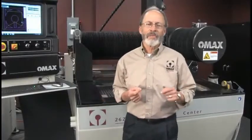There is a myth out there that the key to faster cutting in abrasive water jet applications is higher and higher pressure. But that myth simply is not true. The key to faster cutting is power at the nozzle. For example, a 60,000 PSI OMAX direct drive pump operating at the same pump power and the same abrasive flow rate can cut faster than a hydraulic intensifier operating at 90,000 PSI. And I'm going to show you why.